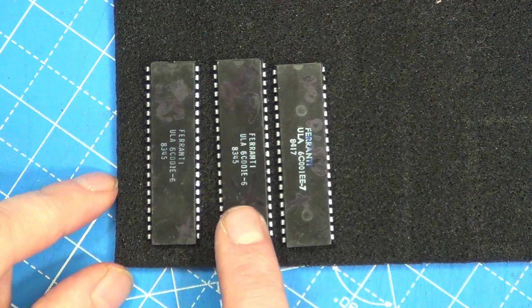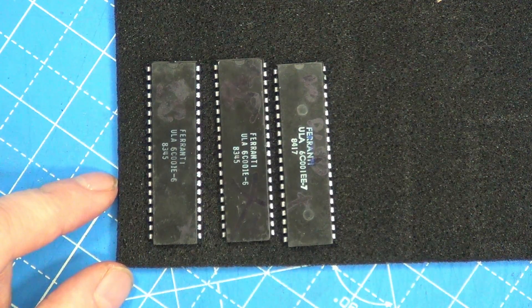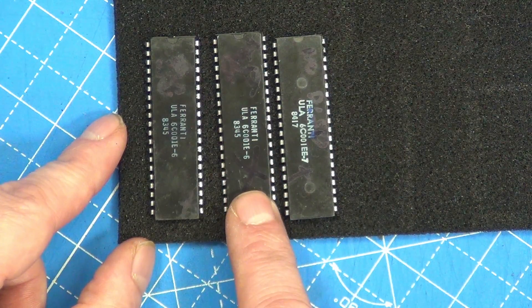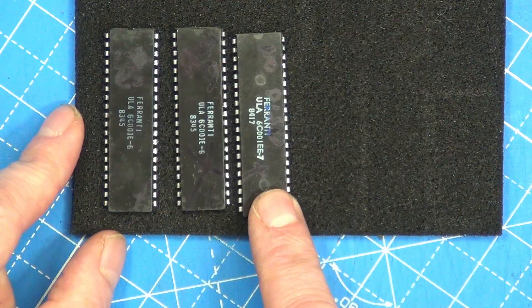These are the three ULAs that we have just taken out of the three spectrums that we tested. The first one came out of my friend's and it's the one that has the black screen with the lines going down it. This time we are using the 0.38 diagnostic, and you'll see on this one it actually fails a lot sooner. Rather than getting all the way to the end and then giving us the lines, we actually get a failure very quickly into the test. The second one was dead on the first test and it's still dead and did nothing. This is the third ULA, and it was the one where we had the white screen we couldn't capture. This time it does actually output but we just go to a red screen, which is a failure very, very quickly.